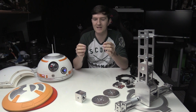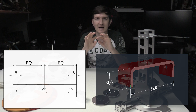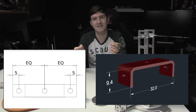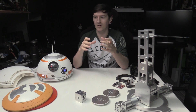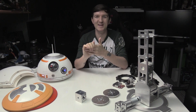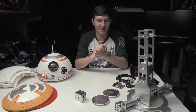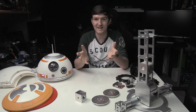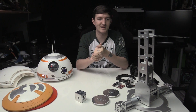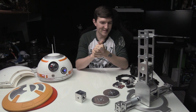One of the issues is that it's designed in CAD — it's a flat image — and when we try to put a bend in it, bending actually stretches the metal slightly, which affects where the holes are, which in turn affects the way everything mounts to those brackets. These are the sort of problems I've got to think about and fix so that this is correct. And obviously when I'm spending so much money on it, it's a worry — you can't change it once it's done, not without more money.